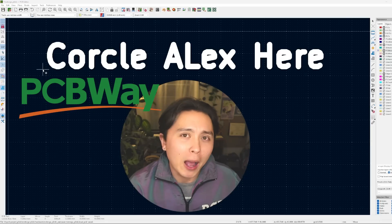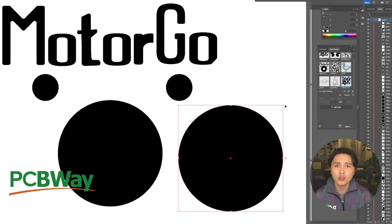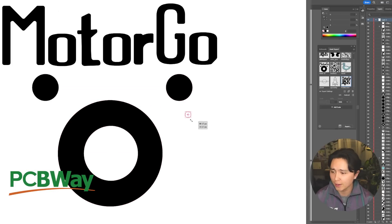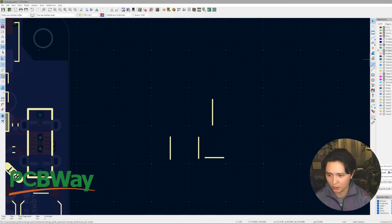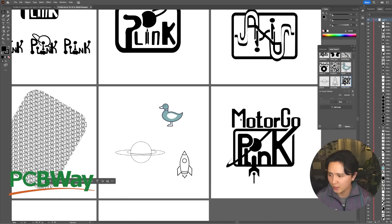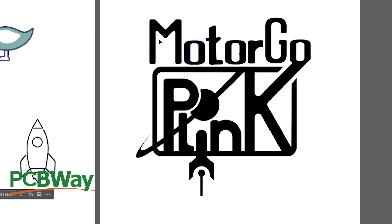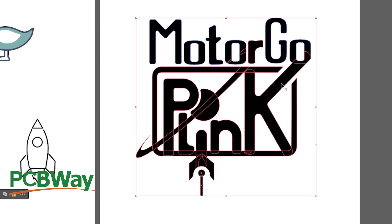If your silkscreen is cool enough, it doesn't matter how bad your PCB is messed up. Their logo is going to go down right here in the corner, and we're going to go into whatever your preferred choice of graphics editor is — something that can export vector graphics. The alternative is doing it all in your ECAD editor with lines, but it just never does quite what I want. So that's why we use vector graphics. Just take anything and export it as an SVG, and note that any color that's not transparent is going to be filled in on the silkscreen.